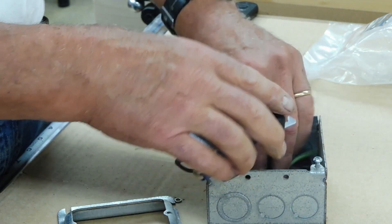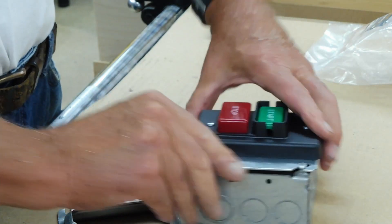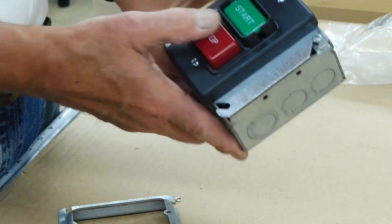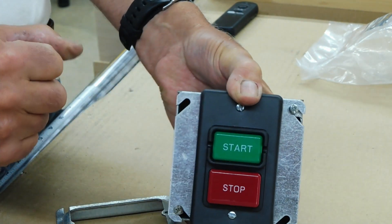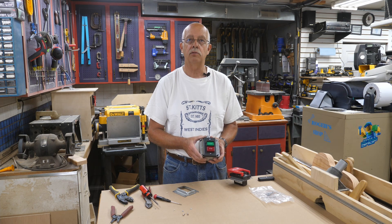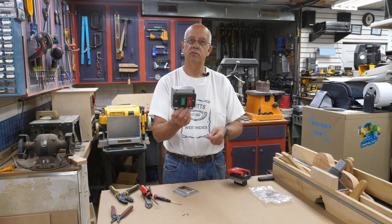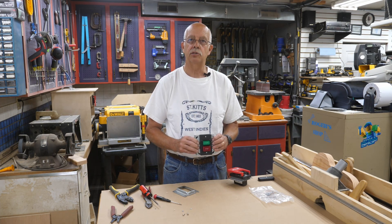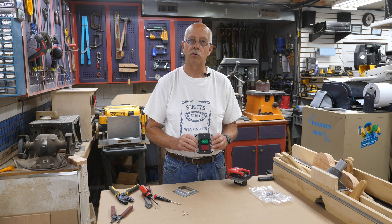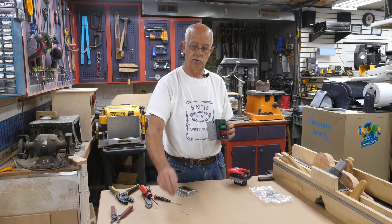Of course, your cables or wires would already be routed through the box with appropriate connectors. Make sure you connect your ground wires together and bond them to the box. Put that on there, tighten the screws down, and you have a start/stop — just like that. For the 71008 PowerTek on-off switch, there it is. A nice way to mount it, simple. All you'll need is a couple of 6-32 machine screws to replace the metric screws that come with it.